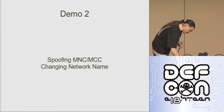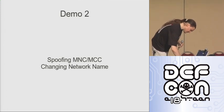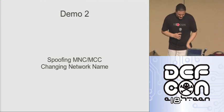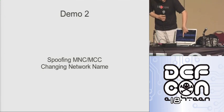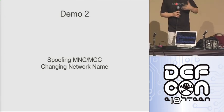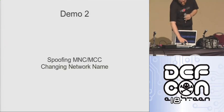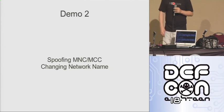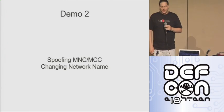I can do config. So here, the cell ID command, 310-410-666-10, sets my mobile country code and my mobile network code. And then this command down here, config gsm.shortname AT&T. And as far as your cell phones are concerned, I am now indistinguishable from AT&T.